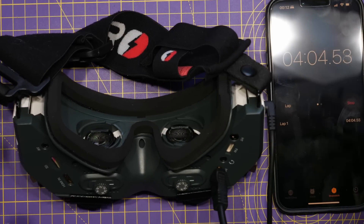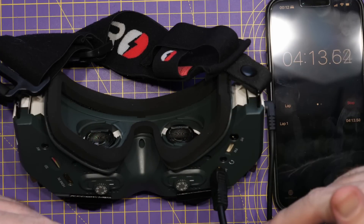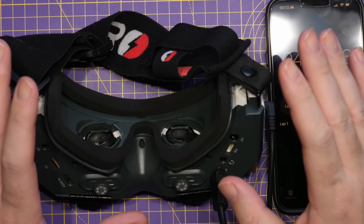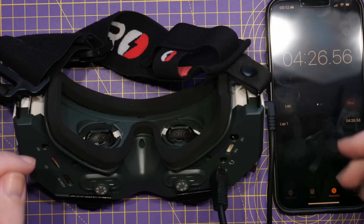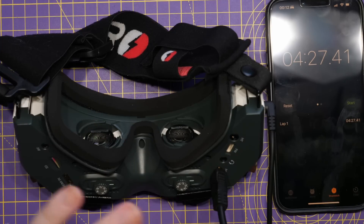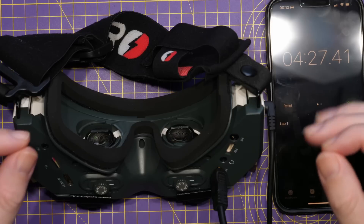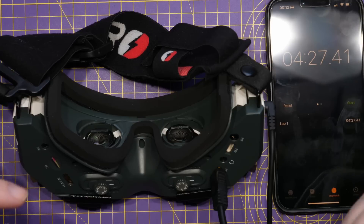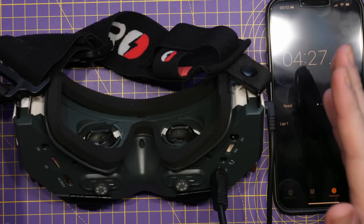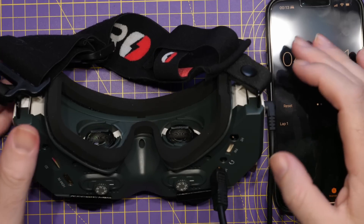The first process went ahead as normal — you see the update through the displays and everything was fine. For the turning-off and then turning-on for one minute, the goggles did appear to power up. I could see a black screen with some OSD overlay but we weren't in the main menu. In the third stage, the goggles turn on and beep and they behave almost dead, sitting like that for just over two minutes. Then there was another beep, the goggles rebooted themselves and came back into the main menu. In that third stage they play dead for a good two to two and a half minutes — just allow that to continue, wait the four minutes, then power down.